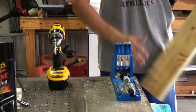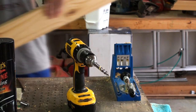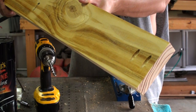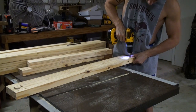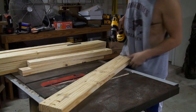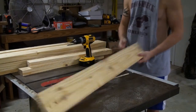We're going to plan out where we want all the screws so that when we're assembling, we're not trying to drill angled holes into an already-assembled piece — it just doesn't work very well. And the last thing before we start screwing pieces together is to drill a few pilot holes. Anytime you're going to put a screw straight through a piece of lumber, you don't want it splitting, especially on a tank stand, so always drill pilot holes.